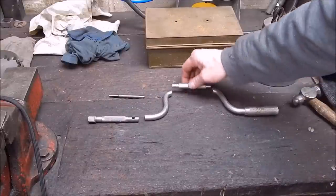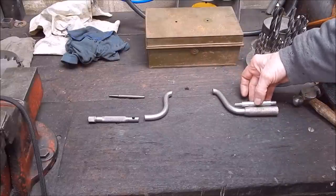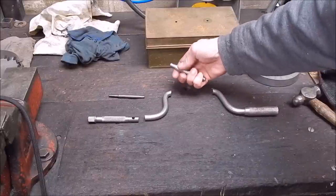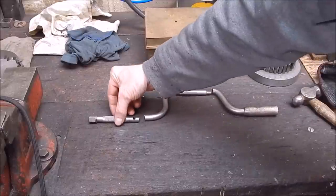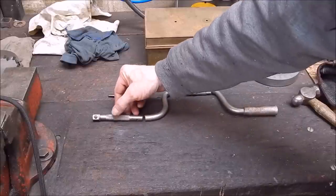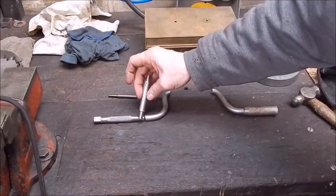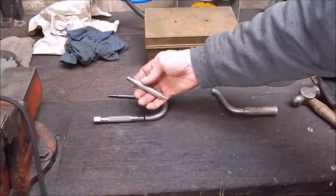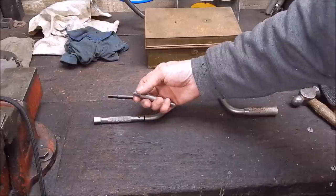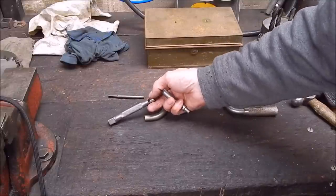So we've cut out the centre and we'll use that for the little crossbar. It's longer than the end bit so we got the maximum out of there, but it's just long enough. I'll drill through on the end — that's going to be our little wrench bar. So now I'll machine this down to fit as the crossbar. Job done — a nice little handy tool.